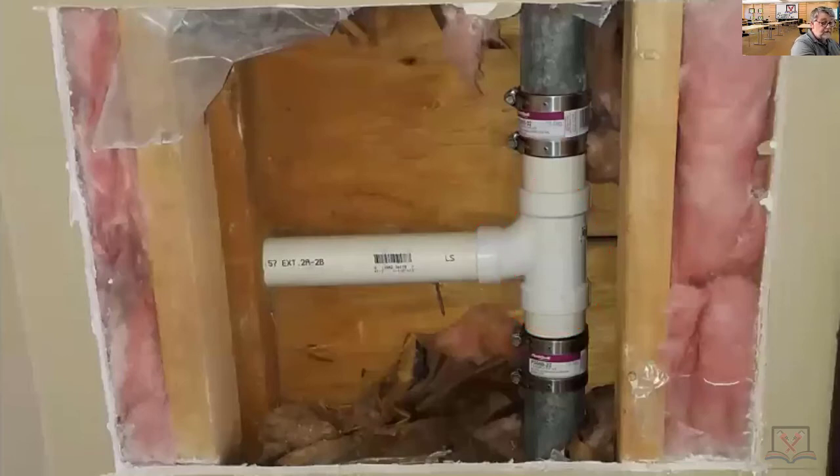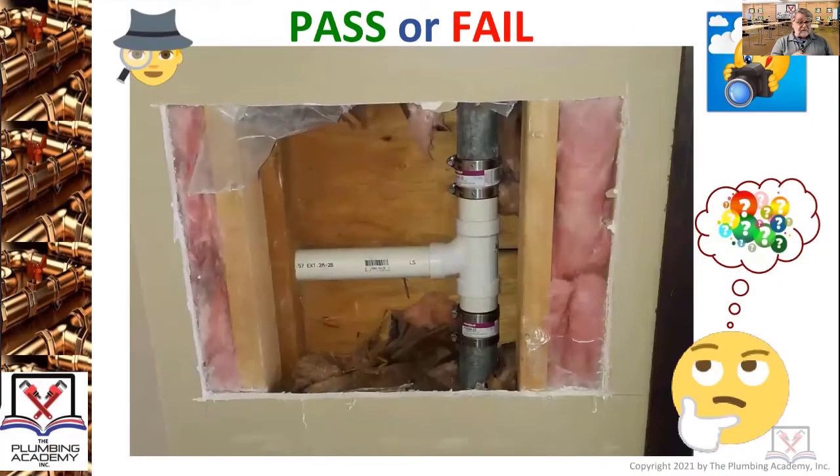You have a 2x1.5 galvanized T, cut, no hub clamp, 2-band, you're good, you're done, you comply with the code. If that's the stuff you're seeing, shouldn't be doing it, not ready to be a plumber yet, people are teaching you wrong. Hopefully a lot of you got that.